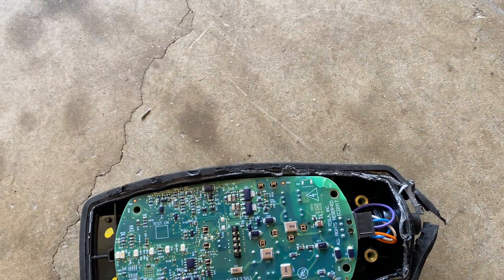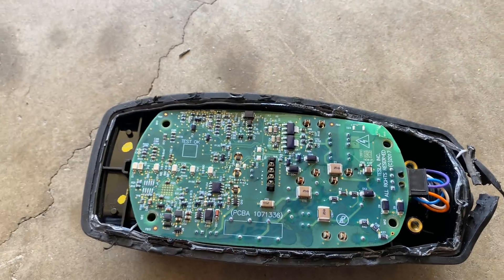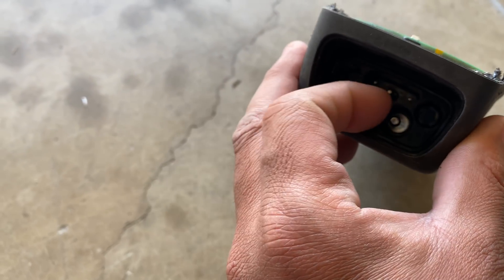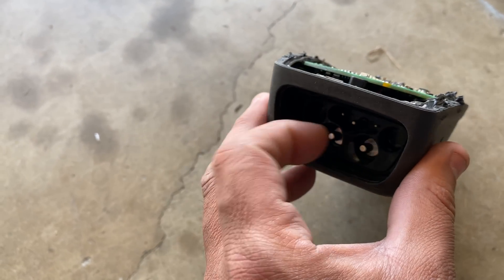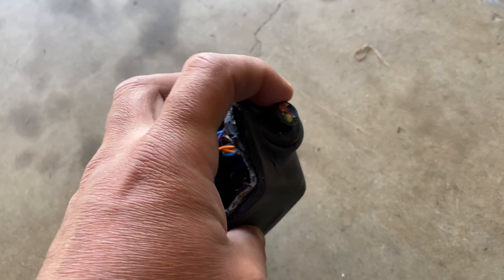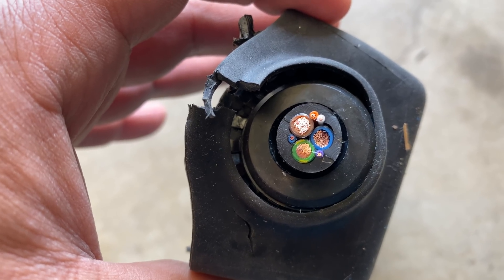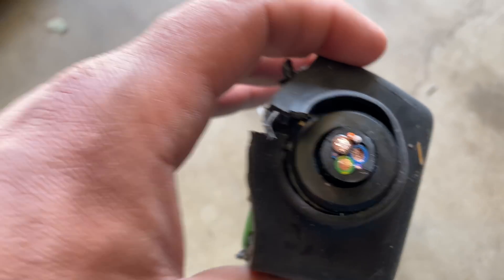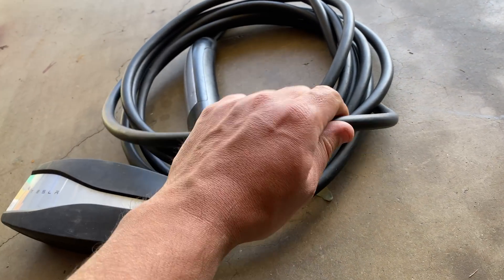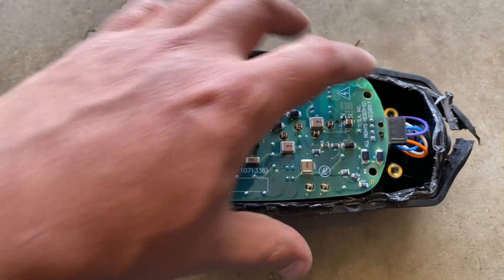It's one circuit board that has everything, with little connectors for components on the bottom side. This is the input — 110 or 240/220 volts, up to 32 amps — and then another cable comes out of here. These are high-quality cables, I think 12 gauge, which handle up to 32 amps. They're pretty small for that gauge, so this cord is deceivingly thin, but it can carry 32 amps continuously.